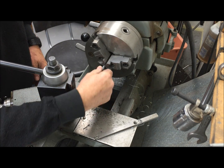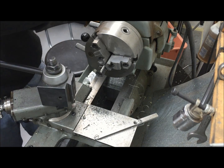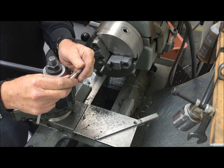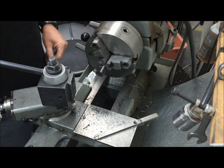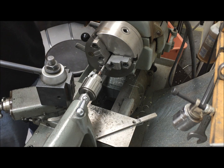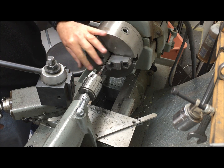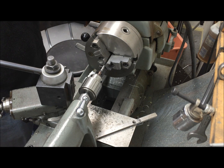I fed in until I've gotten a nice sharp edge on the end. The final step is I have here just an old broken end mill, about three eighths, and I'm going to chuck that up in my tail stock. I'm running the lathe as fast as it can go. What I'm going to do is feed in this piece of drill rod into my stock, and because it's got that conic hole in it, I'm going to concentrate a great deal of heat in a very narrow area. As it heats up, it's going to melt back and continue until finally that conic hole is gone and all that material has been reformed into a disc. It's going to make a bit of noise, but it goes pretty fast.